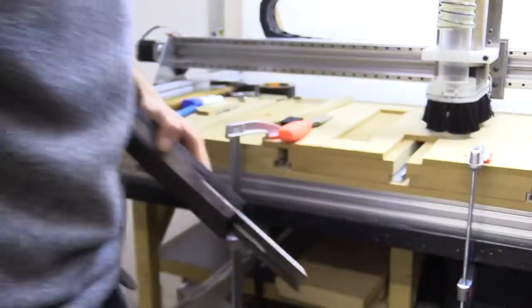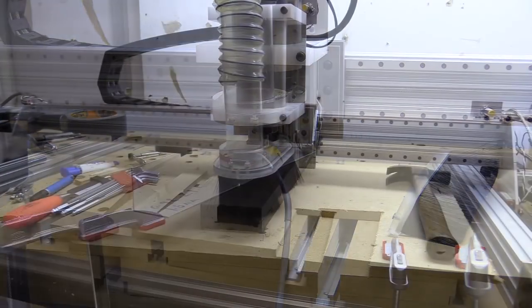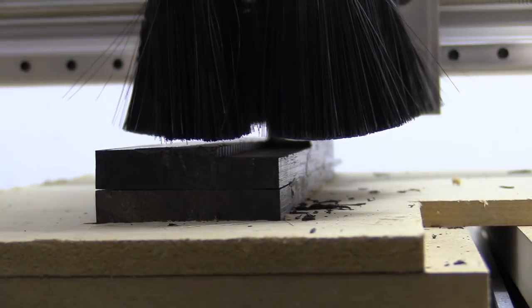I'm not going to go over the detail of how I've done this, not on this channel anyway, but if I have time I'll make a dedicated video on the second channel. But the gist of it is, I had to create a machine relief toolpath and select a tool for both the roughing and finishing passes. There's a few different options for the finishing path, but I'll be using the same tool bit in both instances.